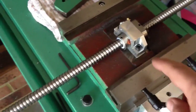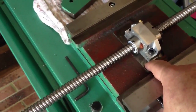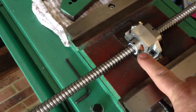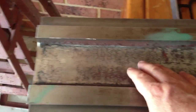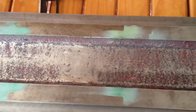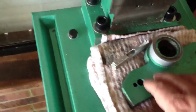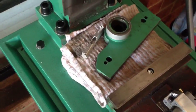I've finished off the nut in my little lathe and put it in. I did have to pack it about 0.8mm with a bit of sheet metal just to lift that nut up a little bit. Here's the actual table — the X table. You can see that I've actually ground all this down with the grinder. Unfortunately I couldn't grind it enough, so I'm going to take it to my workplace tomorrow and mill that down a little bit more. I have decided to reuse the end plates — especially one of them for now. I might make a second new one later.